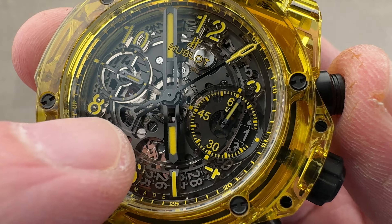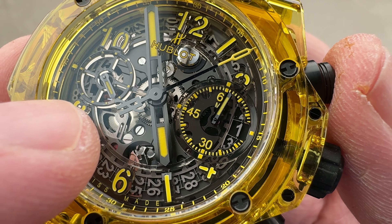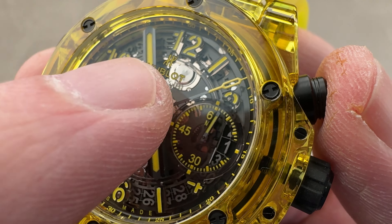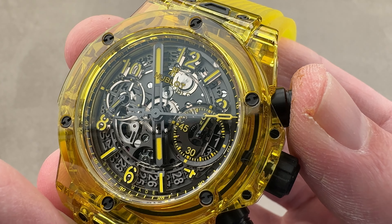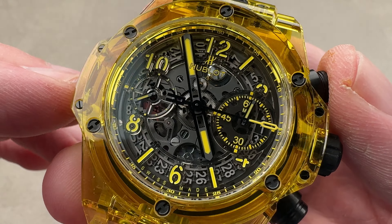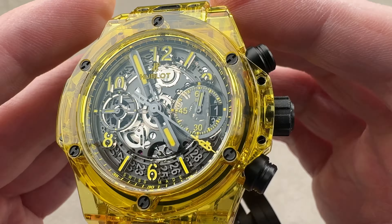Here's the clutch, here's the function selector — note that even that has a little H on top of it. Also note that because of the ultra-fine tooth profile of this driving wheel, we have a lateral clutch chronograph that starts with zero stagger or jump. It starts as smoothly as a vertical clutch while giving us the beauty of a lateral clutch. It really is the holy grail of chrono clutches. There's a sapphire track outboard for reading minutes and chronograph seconds, and you can see a nickel anthracite coating to the bridges of the movement with polished screws on this side.